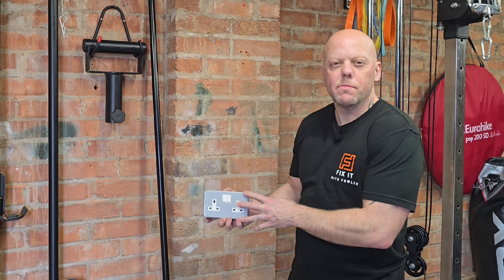This is a really good bit of kit — it's a laser level and it comes with all sorts of attachments. You can mount it on a tripod and it's even remote controlled. I'll do a full review in a future video. For now, I'm going to set that up so we can draw a laser level line and know exactly where to mount it. Once you've got your socket marked, you can drill the holes, put raw plugs in and screw it to the wall, then repeat the process up the wall. I'm going to copy the exact positions of the saddle from the other socket using the laser level. Make sure you've got the correct PPE while you're drilling and fixing.